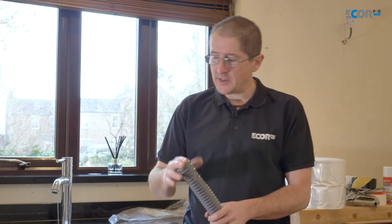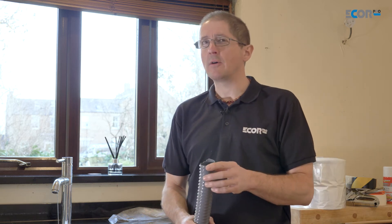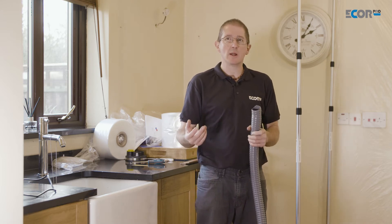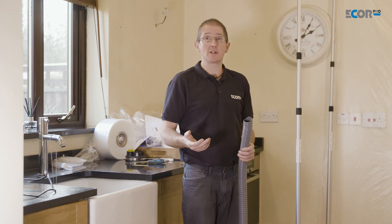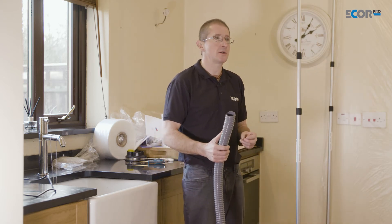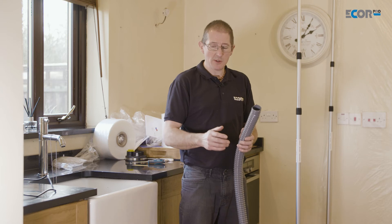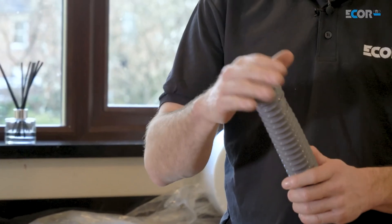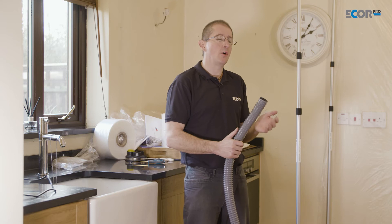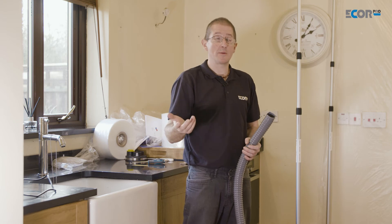It's worth noting that if the dehumidifier is a small capacity and the water leak wasn't really large — as is the case here — there isn't a huge amount of water in there. We're in a kitchen and the kitchen itself can deal with humidity: people are cooking, boiling potatoes, and there's a lot of water that normally goes into kitchens and normally dissipates. Most properties have an ability to dissipate quite a large amount of water. So in this particular kitchen, which is quite a big open kitchen, if we really wanted to, using the smaller dehumidifiers, we could let this exhaust into the kitchen. We could also exhaust it into the hall, where the warmth and humidity will go upstairs and naturally dissipate as it would from the kitchen or shower.